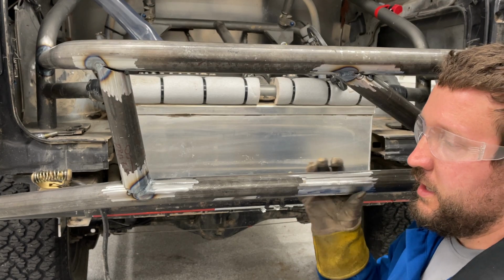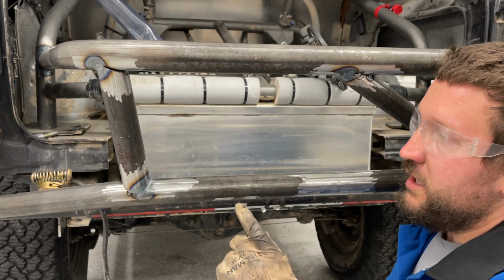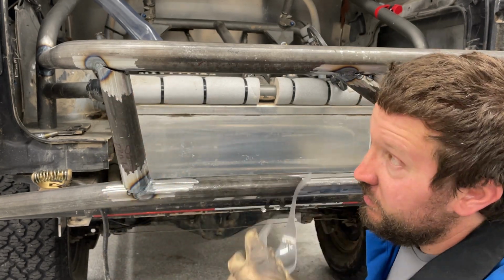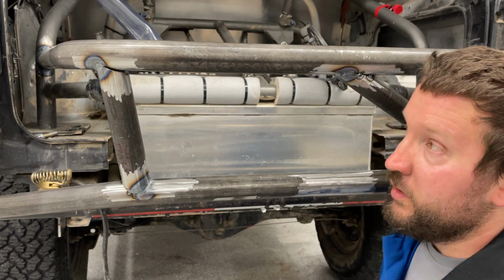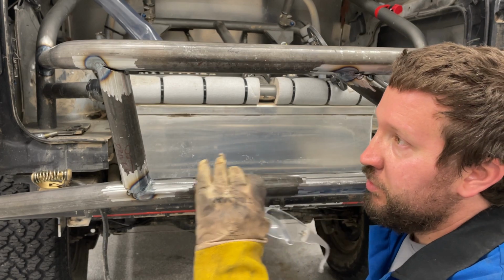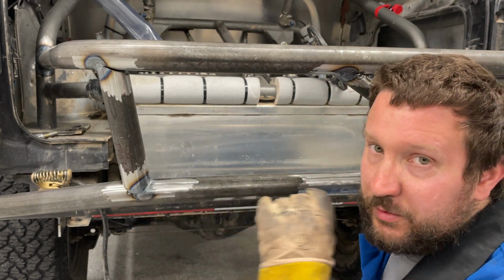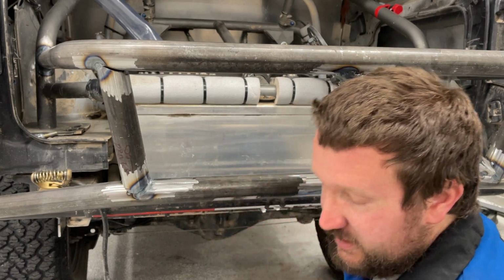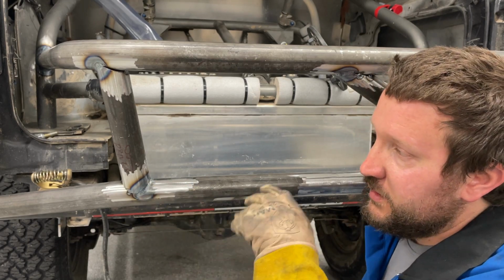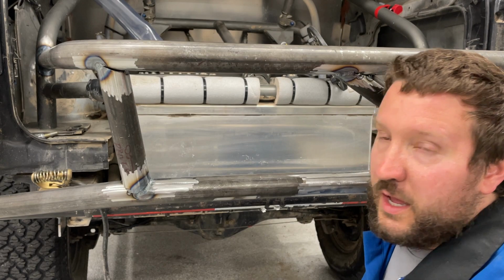I'd like to take a quick break from fabrication to talk about fit up. Fitting up is when you take one base metal and another base metal, or perhaps even three or more, and notch them, prep them, and prepare them for welding. So in roll cage fabrication, it's a little more complicated than that because usually this is going to turn into a node, as in multiple tubes are going to go to a single point and grow from there.